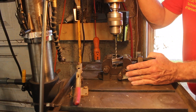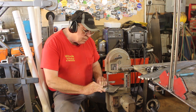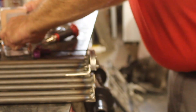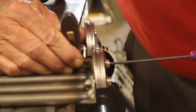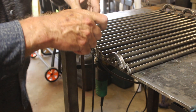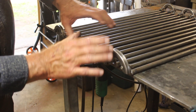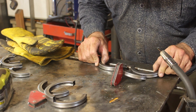From here we'll drill those second stage bearings then trim off the excess length. After that we'll bolt the first stage rockers onto the second stage inside bearings, then go on to create mounts for the outside bearings. Stage one is just these rockers that do this. Stage two is these bearings that do this. Stage three will be to tie two of these together so the entire assembly can do this. These are our stage two outer bearings.